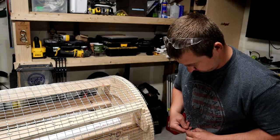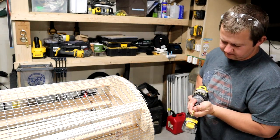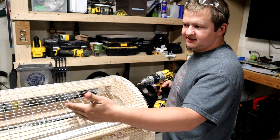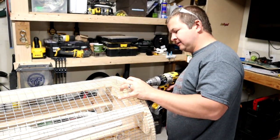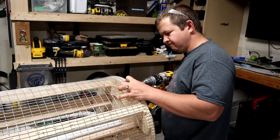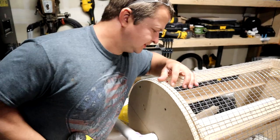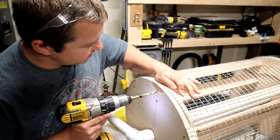A nut and a bolt — I'm going to go ahead and inset the nut into the door of the peat moss spreader and then we'll just be able to push the bolt through, twist it a little bit, and it'll hold everything in place. Use a drill bit slightly bigger, and then drill through with everything in place. We put that center reference line earlier — that's going to be right in the middle. I faced all that drawing on the inside just so I could always keep my reference lines visible. I'm going to get as close as I can to that, shooting in from the backside. We'll do that on both sides — find that center mark on the inside from earlier and put it through right about there. Make sure your door is all the way down and in place.